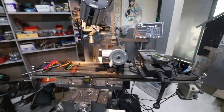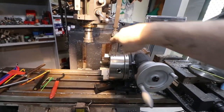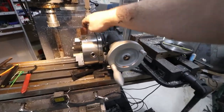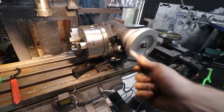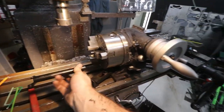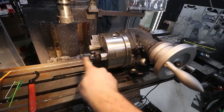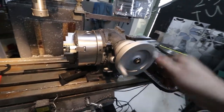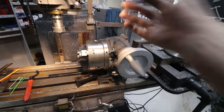Alright, so I've moved from the lathe to the mill. Basically, this is kind of like a big drill press, and the drill goes here, but I can move it around to cut sideways and stuff. So normally you put things in the vise, and I've slid the vise along, and I've bolted down this, which is a dividing head. So when I turn that, you can see it rotates this. So basically what we're going to do is get our gear blank we put in here, which is going to sit there, and then come in and cut it, and then rotate it, cut it, rotate it. Thankfully, there's 36 teeth on the gear, which makes the maths easy because it's just 10 degrees